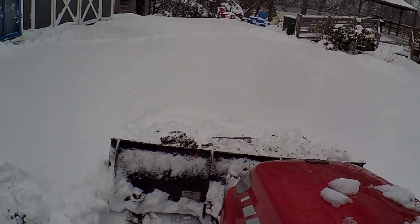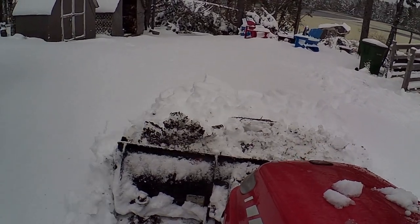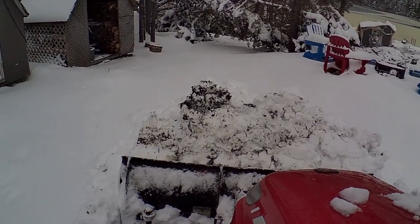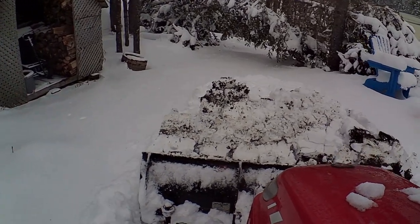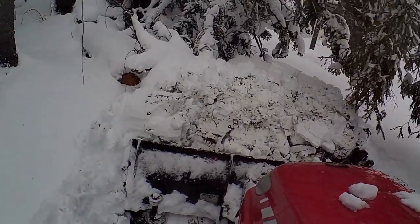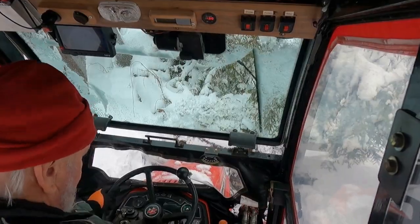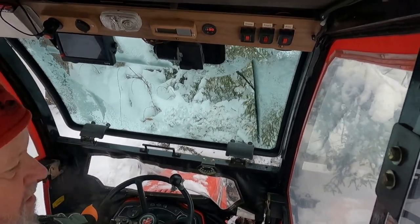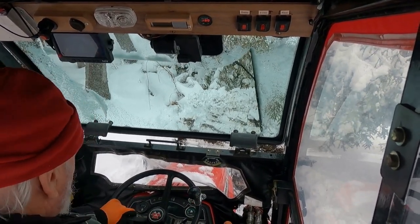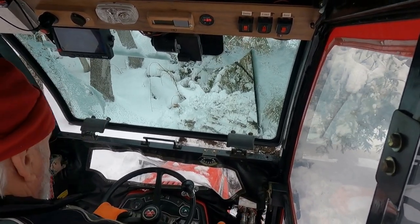This is an interesting little trip I'm making here, because I end up getting the tractor stuck. I'm going through here on the landing — look at all the gravel I'm digging up. I've got the big scoff of snow on the front and we're pushing that right down over the bank. This used to be the trail going down to the lake, but with all the Hurricane Fiona damage the trail is still blocked off — I never got to that yet. I push all that snow in there and now I try to back out — nothing. I try it in low range, try just easing on the treadle pedals so I don't spin the wheels, try differential lock, try putting the blade down and wiggling it back and forth to help push me out, angling it back and forth — but nothing, nothing going on.